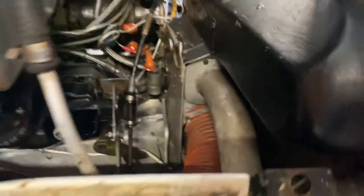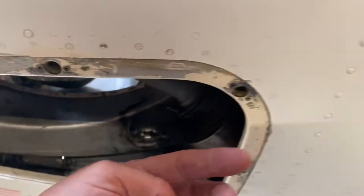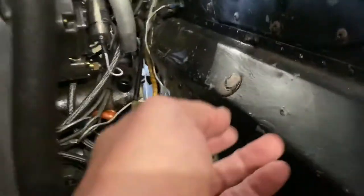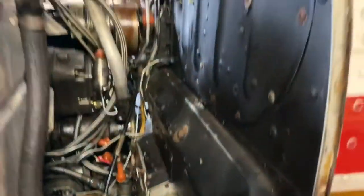That simple. This tube here is the vent to create vacuum for the heater system, so the air coming in — with it hooked up — will be rammed in, ram air in and around and inside, and then with vacuum on the tube on the bottom going out, it creates a heat exchanger system inside.